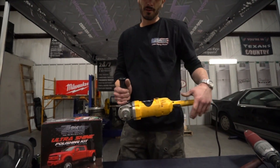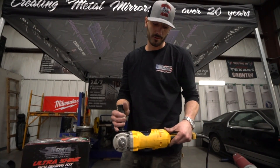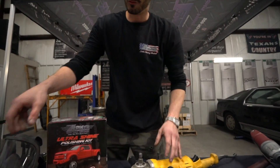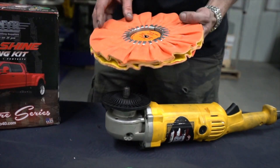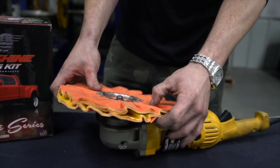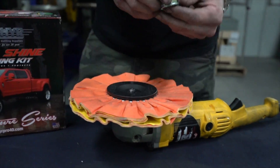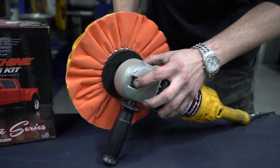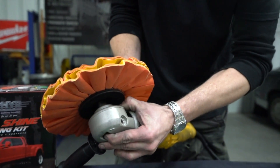Another thing you're going to need is a good grinder. If you're starting off, definitely get a variable speed grinder. It's 0 to 3,500 RPMs — this is a DeWalt DWP 849X. To show you how to put these safety flanges on: you're going to put one down, grab your wheel. Zephyr's going to show you which way these are because these are directional. So put your sticker up, another safety flange down. These have a nut with a washer built in, so just lock it down like this, grab your spindle on the back and just hand tighten it. You don't want to use a tool or a wrench — once it gets right there, you're good to go.